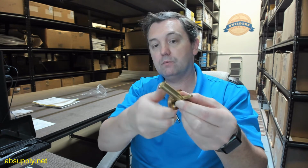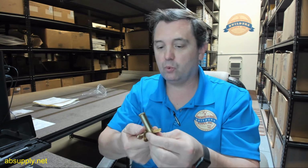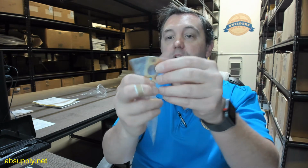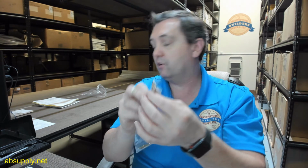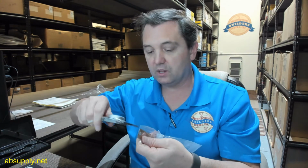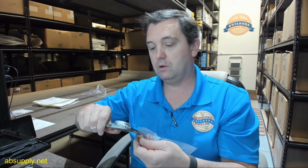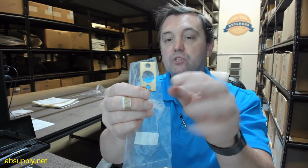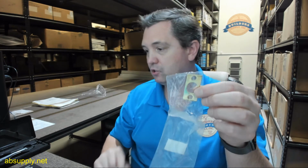Moving on, rub chalk on the end of the bolt, and then mark the jamb, is what they're saying with the chalk. Old locksmiths, they've used lipstick, of all things, and that works as well. So you can mark the center line of that. That material is going to be really thin, maybe 30 thousandths of an inch, including the plastic that's there. It's 0.045, so that's going to be so thin that you might just surface mount it. Mark that, chisel it or surface mount it, pre-drill the holes and attach.